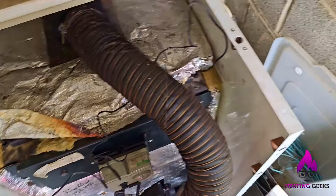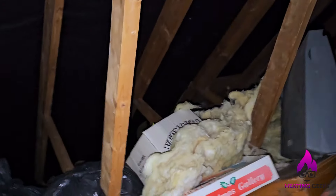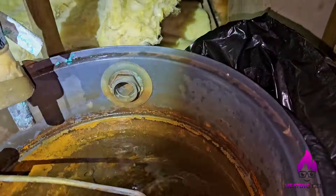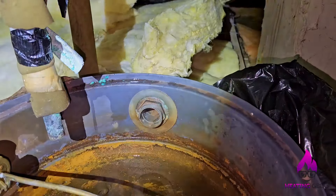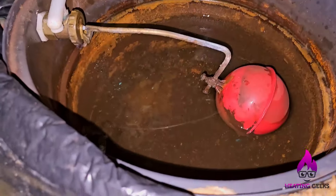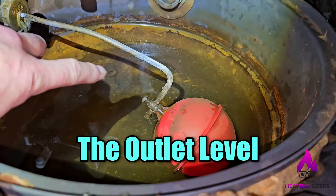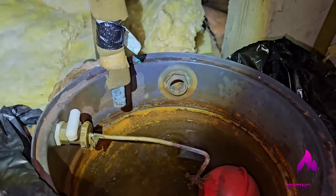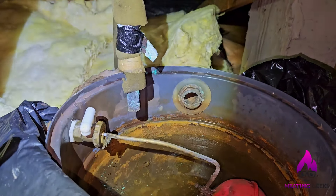So - loft, check the tank. There's a refill - refill's over there. That's hot. As you notice, the tank is full of water. It's well above the level, well above that outlet. The expansion pipe there was warm. Because that's warm, I know that that's clear, because it was expanding up into that when it's banging and crashing.